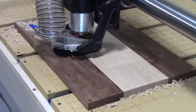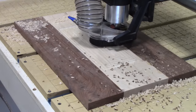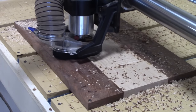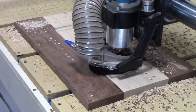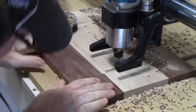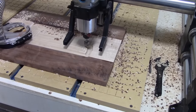Now we're going to take it over to our CNC and make our pocket. You're going to see there is a big mistake that I make here. Best I can figure, I didn't tighten my bowl bit down enough into the collet, and all of a sudden things kind of go awry. The bit slipped, it dropped, and ruined this piece of wood. That just sucks, but you live and learn. Thankfully I didn't break the bit and I didn't damage the CNC, but this section of wood is pretty much useless.